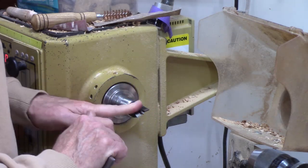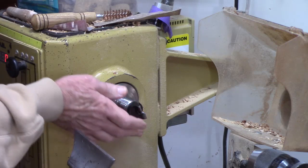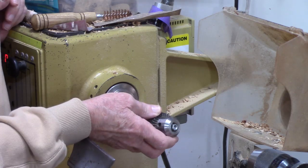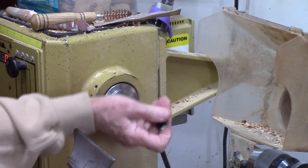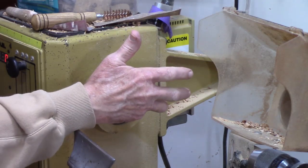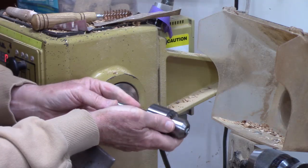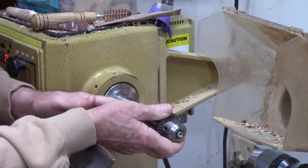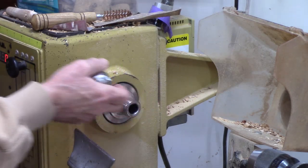I was helping a friend make a tool handle — he always used a chuck for almost everything. When we put in his Jacob's chuck, which had no draw bar, it just rattled around and I didn't know what the problem was. When we removed it, I put my finger inside and it felt like things were biting me. It turns out there's a term called galling — he had apparently used a drive center or Jacob's chuck that had damage on it. When he put it in, it didn't seat properly, rattled around, and did severe damage on the inside of his spindle.